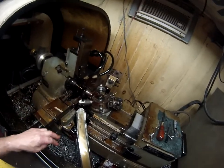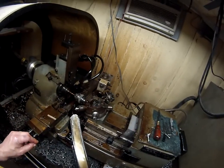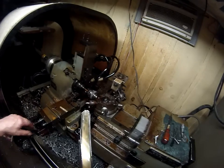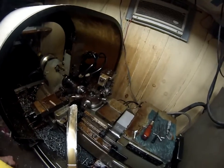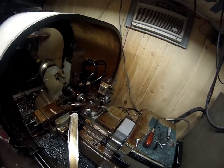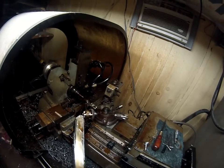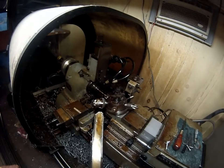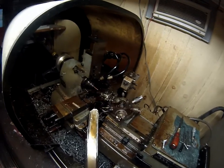Once you set up a machine like this, you don't want the tool bits to get dull — you do everything you can to protect the tool bits, because setting it up takes a long time. This is a finishing adjustable hollow mill. It finishes the outside diameter of the thread — it's a 3/8-24 thread. And then we're relieving that hole right there, which will be part of the brazed connection.